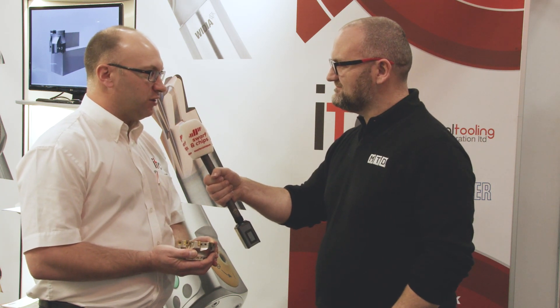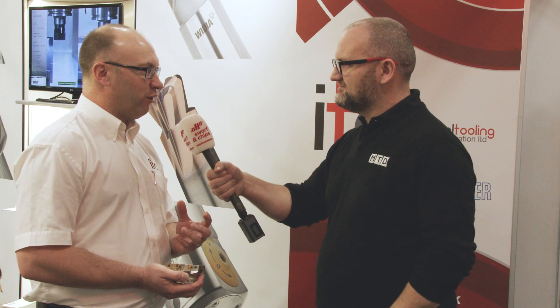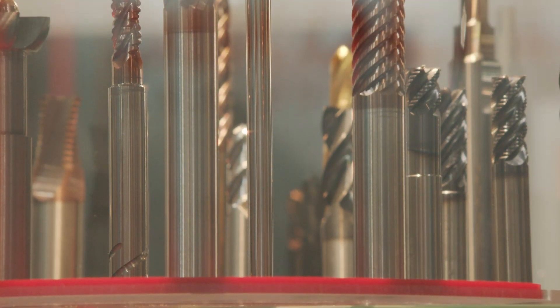From ITC's own range, they now have aluminium cutters with chip breakers in the flute. When you're using trochoidal-type milling, the problem is swarf control. With the little chip breakers in, you get easier swarf control. If you can manage your swarf on trochoidal, you can do the application very well — it stops the tool from wearing in corners and prevents failure. If you're running lights out, swarf becomes an issue. Generating lots of long needle swarf can bung up your system. Keeping it small and compact means more room for the swarf to come away from the job and fill the swarf bin. Sometimes it's just the management of the swarf that controls whether you can run the job lights out.